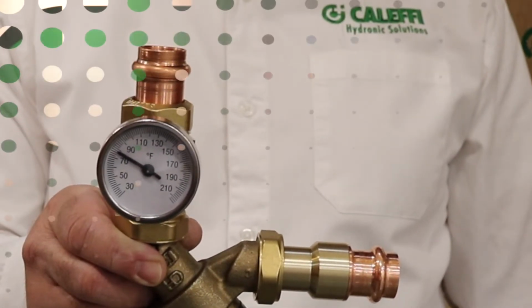Now, in the case where you've got, say, a demand for 120 degrees out of your mixed outlet, you might need to have 135 at the hot inlet or 140, for example. Where we see this as most problematic is typically going to be the startups of a lot of your electric water heaters and your heat pump water heaters.